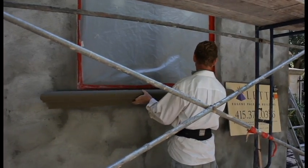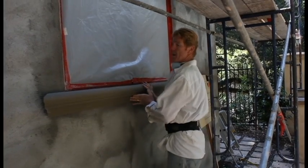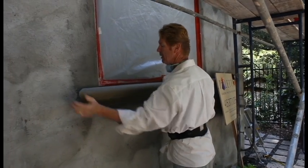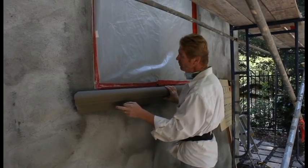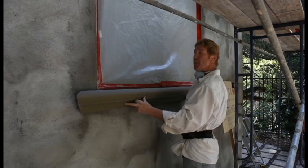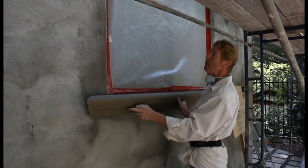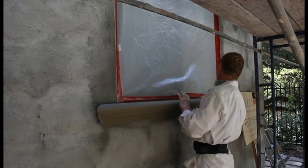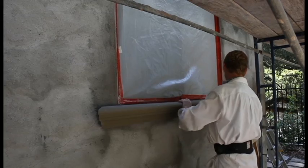What we're going to do today is place these guys on here. We're going to have a surround too that's going to come on here. We're going to miter the corners, miter these, shove them in here. We're going to mix up poly bond and set them with the poly bond. I always like to have at least two nails in every one of them, so while the poly bond is setting and curing, it has something permanent. I just put a little poly bond over the nail hole. These are going to look really cool — they're going to even bypass those which are excellent looking.